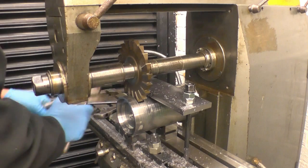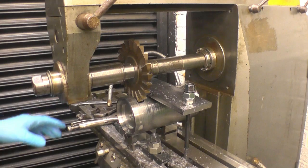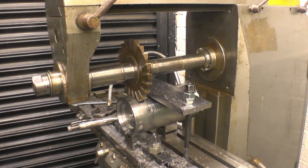I'm quite pleased with the miller and where it's performed. One thing I've realized is you've really got to clamp things down tight - I need bigger V-blocks on here. There's a lot of torque going through that cutter, but on the whole it's worked out quite nicely.